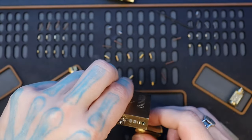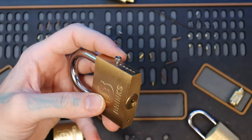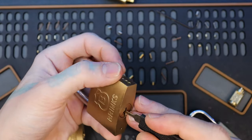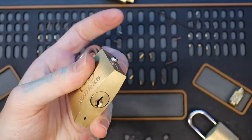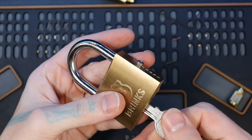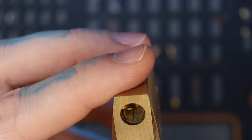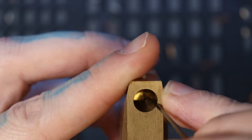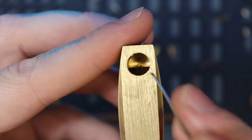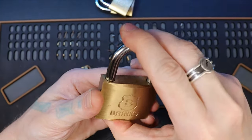When we put our — let's see, make sure there's nothing left in here. The springs are in there; the springs won't fall out, luckily — we won't get them in the keyhole. So if I want to put this back together, I put that in there to go on both sides of the actuator, give it a slight turn to make it go straight, and then tighten this up right here. That is what allows that to be held in. As long as we have our plug in, these actuators will not shoot into our shackle hole here. If we remove the plug, the tailpiece — the back tailpiece moves, and these will shoot into the shackle hole if the shackle is not in place. So if you decide to do that and take on one of these endeavors, that is something to keep in mind.